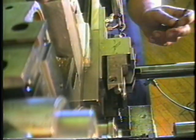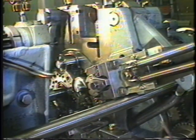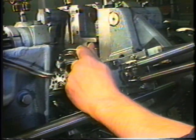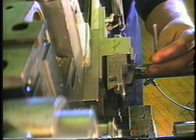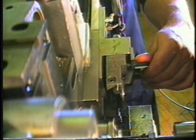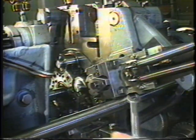To move the tool closer to the revolving head, first turn the 5080-281-32 adjusting screw counterclockwise to take up any backlash. Loosen the two 835-14-32 screws slightly. Move the tool, then re-tighten the two 835-14-32 bolts.